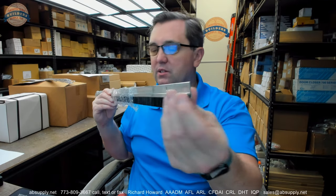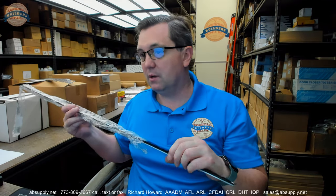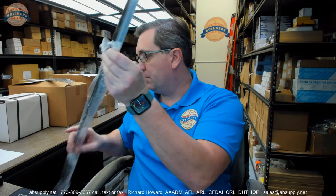The 802 is representative of this profile — what it looks like, the holder with the inserted bristle. The 802S indicates all of that. The MIL means it's a mill aluminum finish. The B stands for the bristle. The MIL and the B are variables in the part number. Let's switch to the screen view to take a closer look at how the part number changes based on the available options.